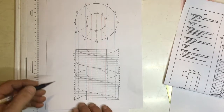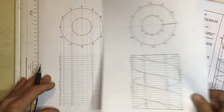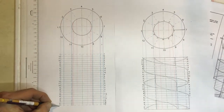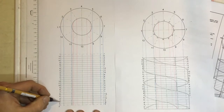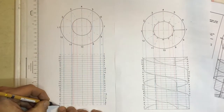Let's just look at the numbering. It is a left-hand square screw thread. So we know that our starting point A is over there and down at the bottom there's starting point A. First of all, I like to number it 1 through 12, then 1 again. That gives me 12 spaces.